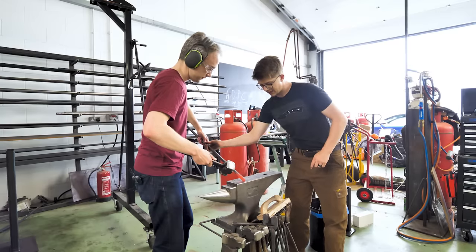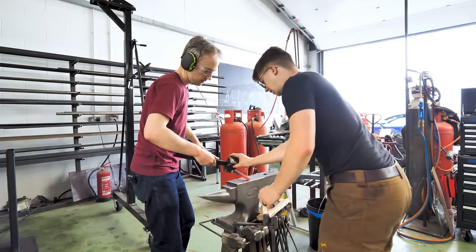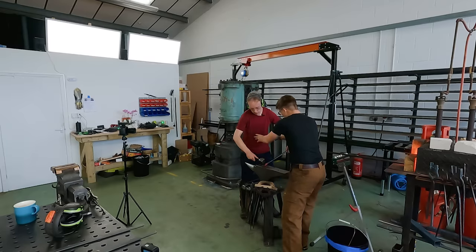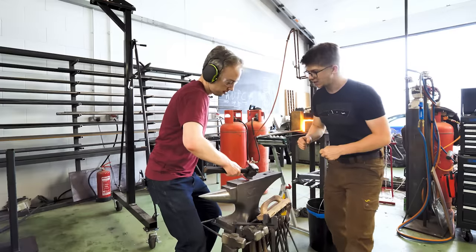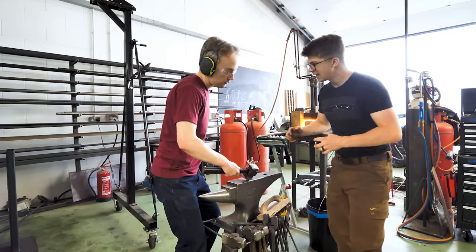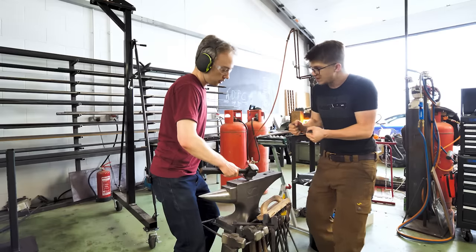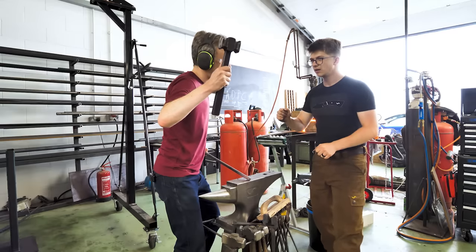And then drop that shoulder some, so you can relax a little bit like that. As you come with your hammer right here, there's a really big gap between your elbow and your body. I'd like to close that up. So if you can bring your body in a little closer to the anvil like this and scrunch down a little bit more, you want to think about having that elbow in just a little tighter as you hit. Everything closer in means you have a smaller moment arm, so you've got a little more power. So it's better to be close in when you're hitting the hammer. Now lift that hammer up like you want to take a swing. Yeah. It's pretty good.